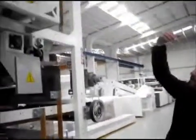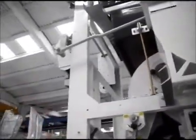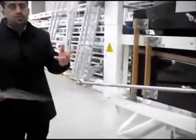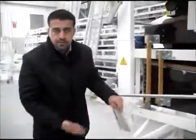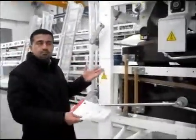Now once your seed is up in the first screen, you are going to remove the large impurities, which will be discharged from this chute into a sack. As you see, they are not here, but there will be a chute right here into a sack. So there are two ways to manage your large impurities: you can keep them in a sack, or you can have a screw conveyor or a conveyor belt, so you can take it wherever you want to.